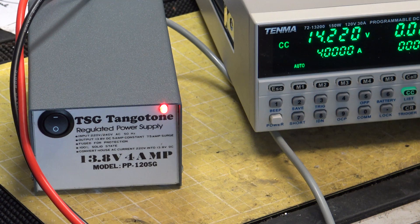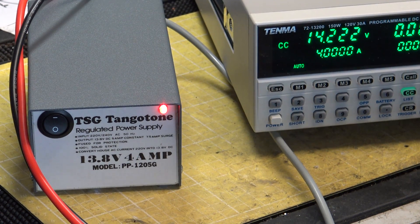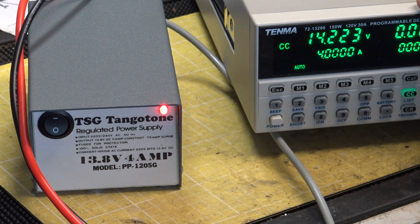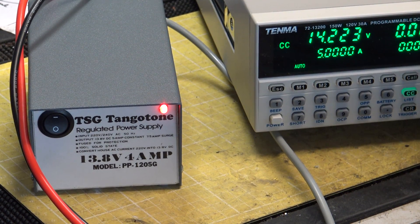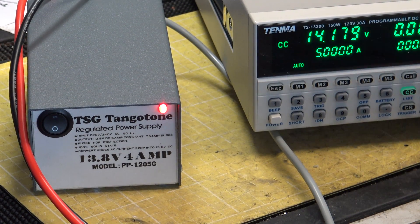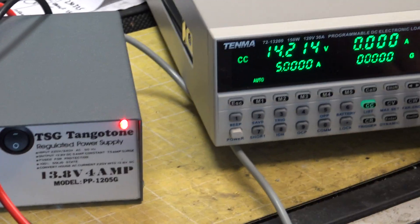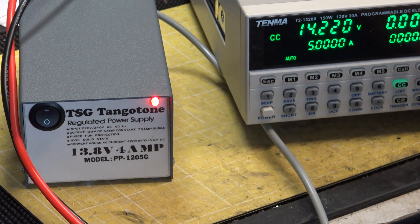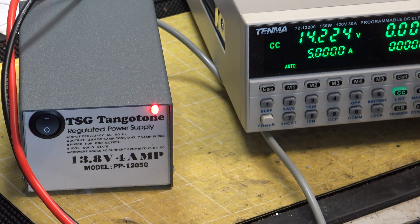By the way Chippy, this is supposed to be a five amp surge — just dial in five amps for a five-second surge. We might blow a fuse but it'd be interesting. Go! 10.3 — stop. So yeah, it's four amps, which is exactly what we say it is. So there you are. Thanks for watching part four of our power supply replication of the same circuit used in really reliable but banned Taiwanese power supplies from 1980.